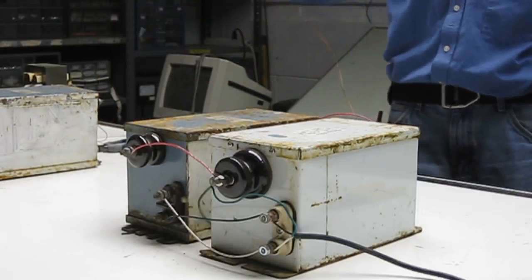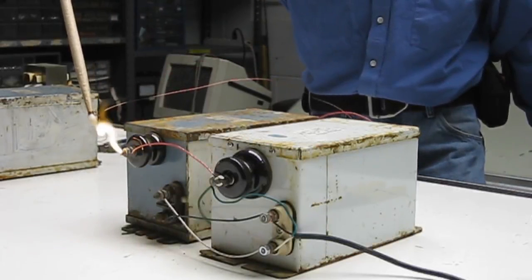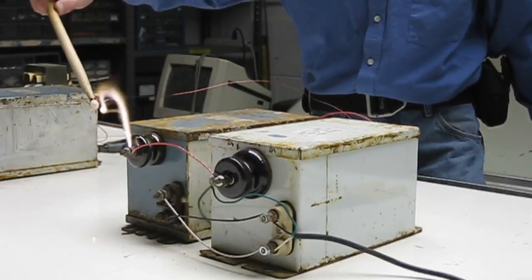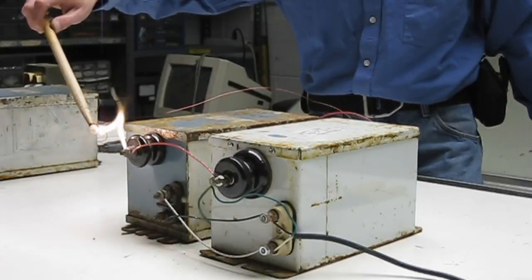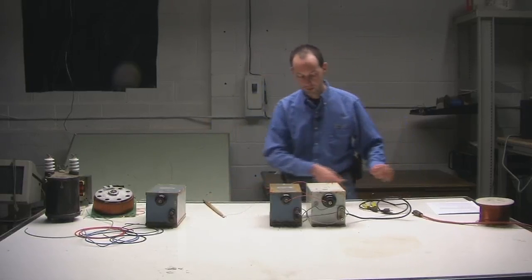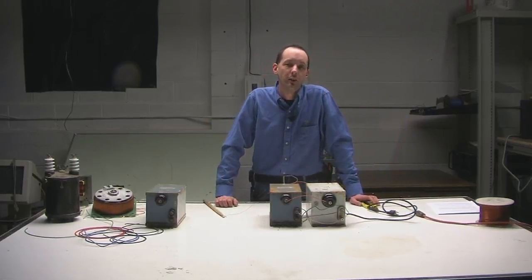We'll try it right off the electrode. It's hard to see. Isn't that great? Look at that. And it's so hot, it's melting my wire. That's fabulous. Now we'll disconnect that. Safe. We're good. So yeah, that's how to phase an NST and some basics on high voltage safety.